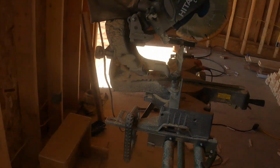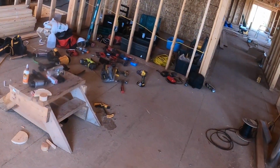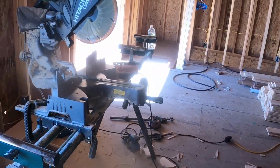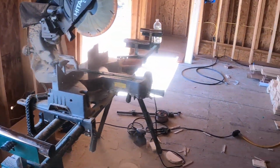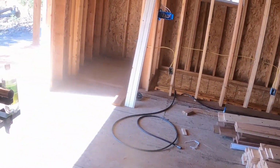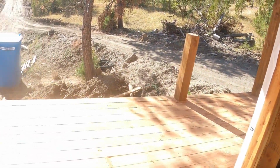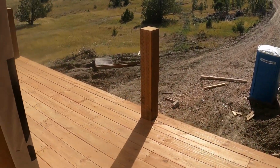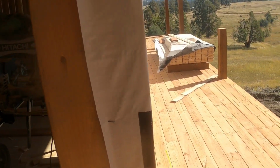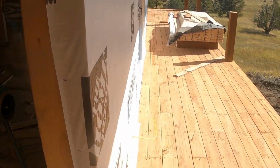what's the word I'm looking for? It makes it hard, especially because that ground's uneven. And I don't have a tilt function on that forklift. I can go in and out, up and down, back and forth, front to back, and I can side shift, but I don't have a tilt function like some forklifts. So if the ground's uneven, I lose that. So that'll give me 2.5 inches to spare when I go to lift that thing on and off.